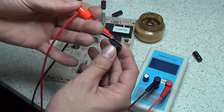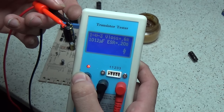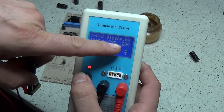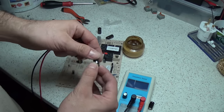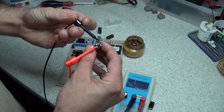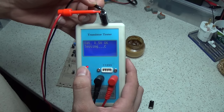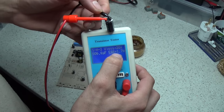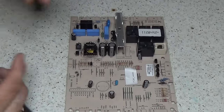Now, with the tester, we connect up the good one. As you can see, we've got a thousand and twelve. This capacitor had about a five percent tolerance rating, so that's within the parameters. But we'll just test the old one here. And as you can see in a second, we've only got half its power showing. We've got five hundred and six microfarad showing. So that capacitor is definitely down.